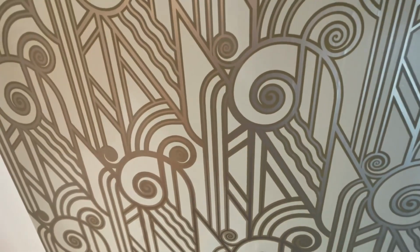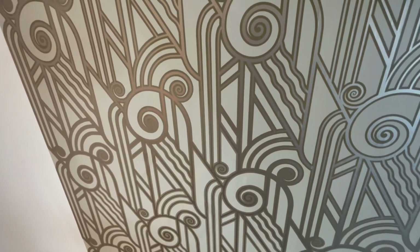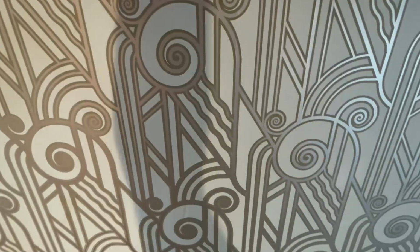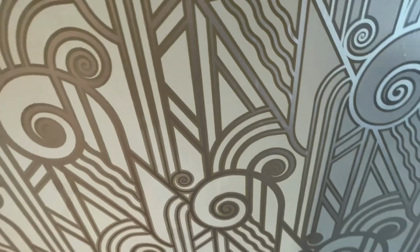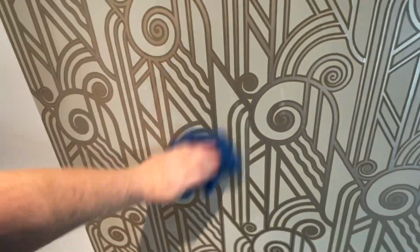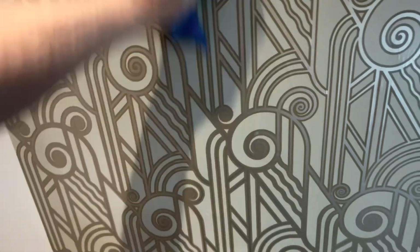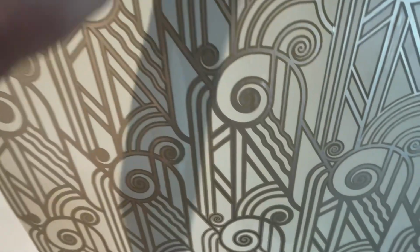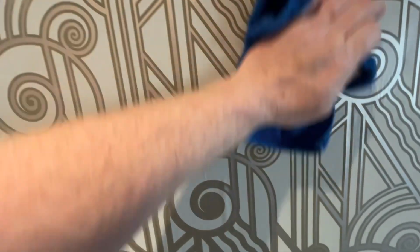The wall covering has expanded on the table. The paste is clay. Oh yeah, makes this wall covering a lot harder to work with. As you know, clay dries quickly. And it's super tacky, which means you have to use a lot of muscle to spread your wall covering out, to get the buckles out. But there comes a point when you have to know that smoothing it out is going to hurt it rather than help it. So when you get lines like that, you leave them.